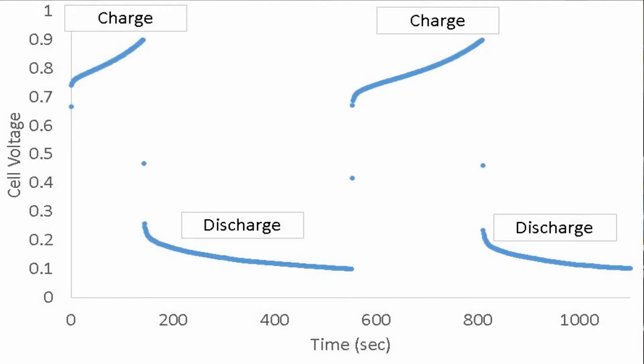You have to be a little careful charging this kind of battery to keep the voltage and current low. Internal resistance is definitely still a problem, so there's work to be done. But it's nice to see that it still performs similarly with carbon and no copper. Copper wasn't a big part of the battery chemistry. The charging voltage and current needs to be maintained at a low level, but it's still definitely capable of accepting and then giving back a current. So we definitely have a battery — it definitely has a measurable capacity and it does not require copper.